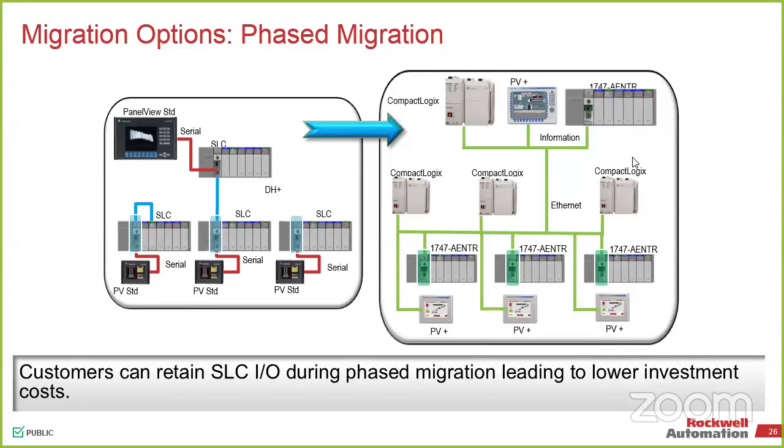A lot of times, what's usually driving that, I sort of guess what you're doing, is either an HMI that's running some strange protocol, or the fact that they don't want to pull the media out. And that's where we'd say, well, ProSoft makes a DH+ to Ethernet gateway, and we would throw that in there. But they were not really comfortable even installing anything on the gateway. Yeah, and the other gateway solution, because ProSoft does have a DH+ RIO to Ethernet gateway, not in chassis. They're checking, but I think Joe's right, I don't think we have anything that goes in chassis for DH+ on CompactLogix. The new ASCII module that I mentioned is ASCII, DF1, and also Modbus RTU, but it won't do the DH+.